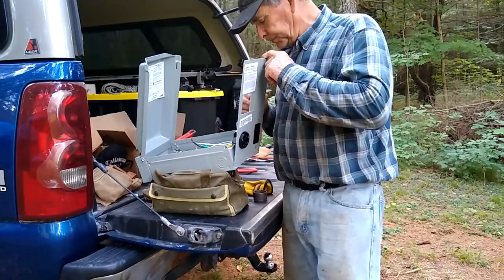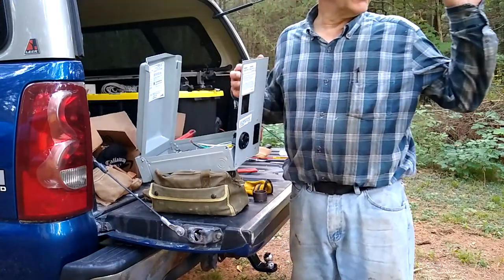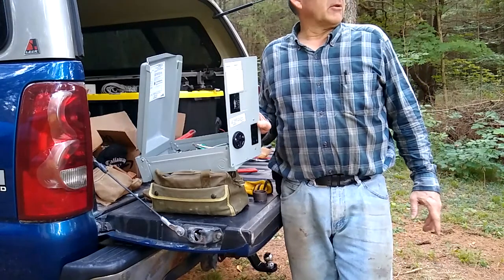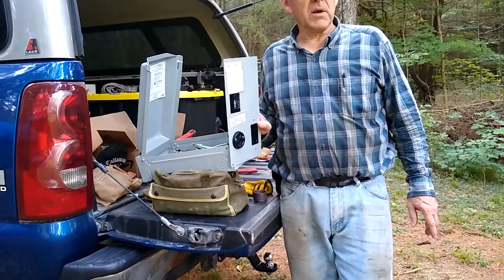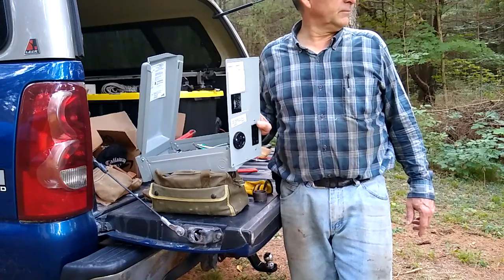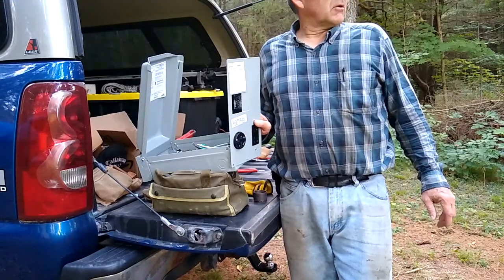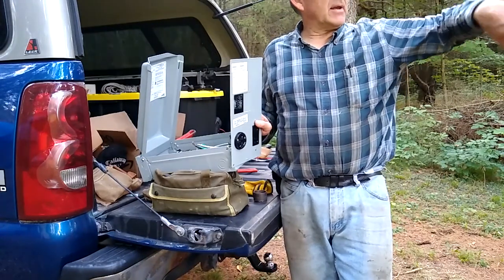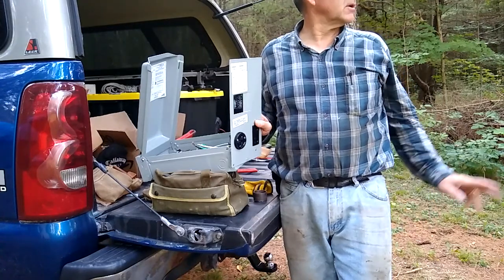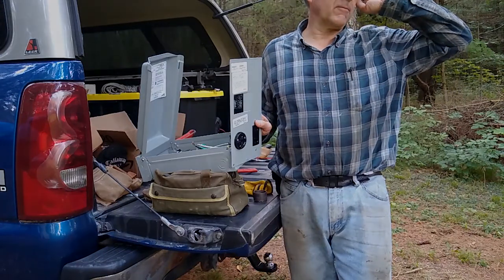I'm going to tie into the 30 amp breaker to run wire. I think I've got to run it around 200 feet, a little more. So I'm going to drop down to probably 8 gauge copper wire to make that long run because of the voltage drop. Eventually I'll dig a ditch for that and lay that 8 gauge wire plus my water line, all going in that ditch out to the point where I'm going to set up a platform for the RV.